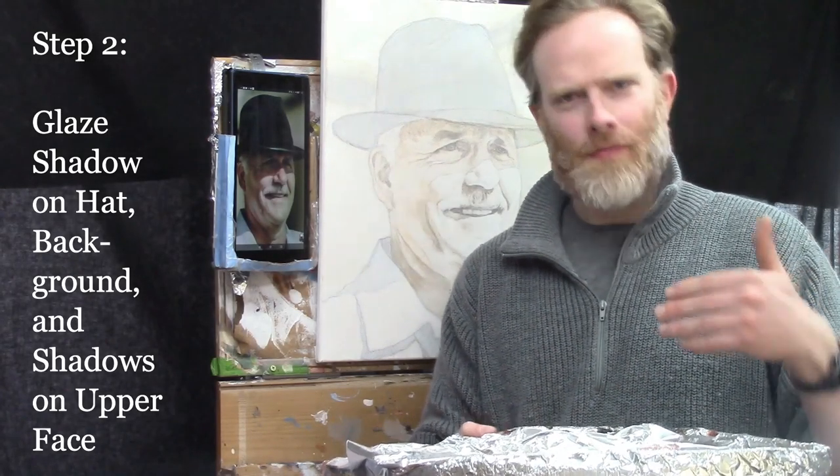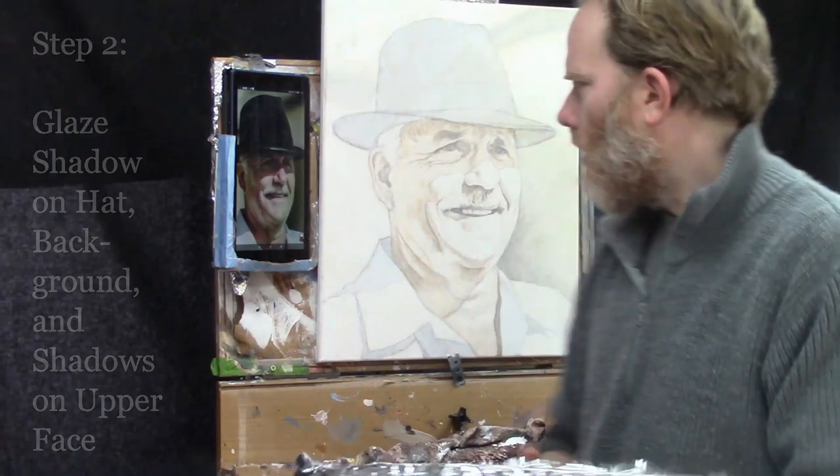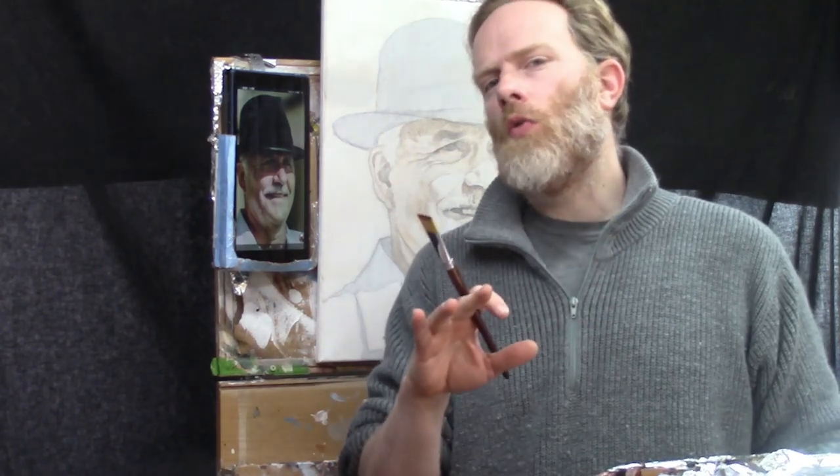Now for Step Two. We just want to cycle back and revisit some of the areas that previously had dried. You're always wanting to hop around from area to area, giving each spot a chance to dry completely before adding another layer of glaze. The worst thing you can do is start adding another glaze on top of an area that's still tacky and wet — that's a recipe for blotchiness. So let the area dry completely, go to another spot, then come back and work your way back, rotating to the spot you left off last time.